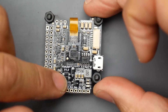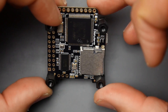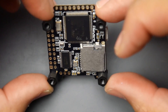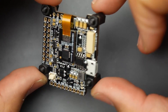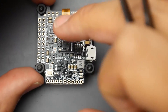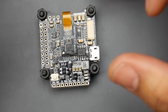There's a boot button in case you need it. The overall board is really nice — just a beautiful F7, and it's a large chip. We have SD card expansion, which is a huge plus, and a barometer, which is really nice as well. There's also an 8MHz crystal for the MCU. Overall it's a great board, and I'll be setting this up as my testing platform for Neuroflight. With the SD card, sensitive gyro, OSD, and barometer, I have everything I need — even altitude hold AI down the road.